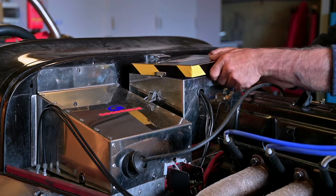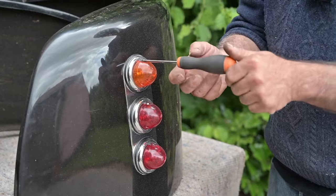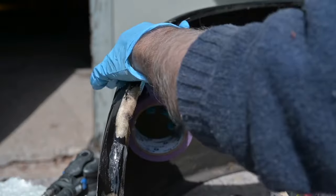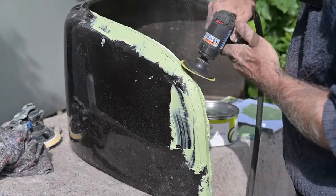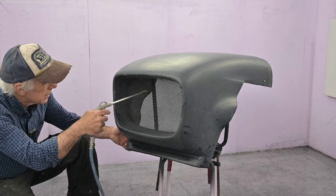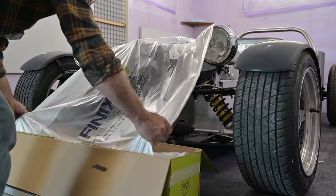Finally I could hook up all the different parts and clean everything up, because there was a lot to clean on this engine. Then it was time to do some work on the body, which had the expected scratches and dents. The good thing is it's all polyester so it's not that hard to repair. I made several patches, put some putty up, had some gel coat applied, and then it was ready to be sanded and given the first base coat in the paint booth. This is a high-build primer, and after rubbing it down I applied a two-coat paint — the colour coat and then the varnish.